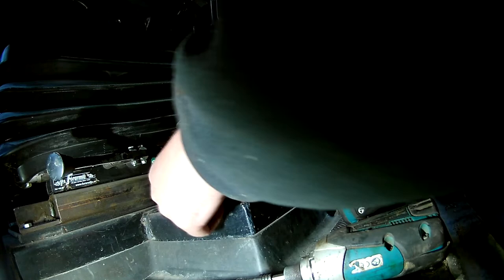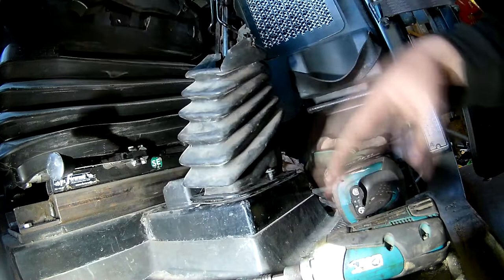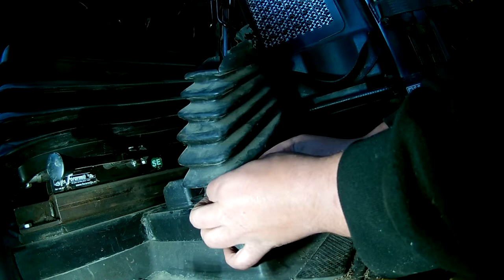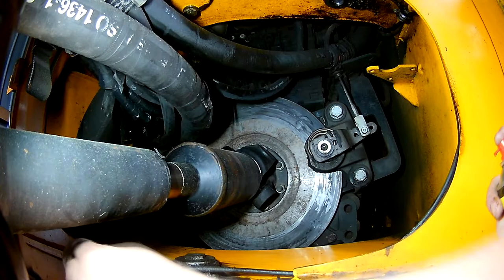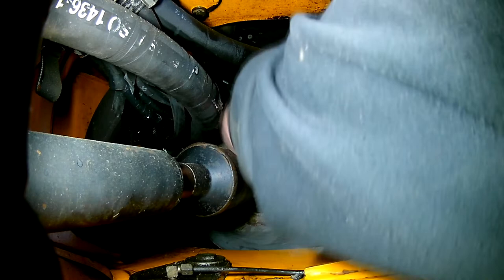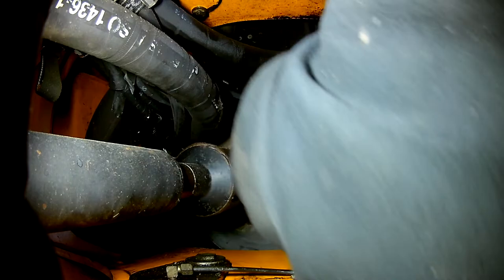I'll come to an even more annoying thing here. There has been signs of some oil leaks under the cab, so I was gonna clean up that. It seems there are some models that have a hydraulic parking brake — this one just has a cable operation. It was a little bit oily with some grease down here, so some cleanup. I made sure that the brake disc for the parking brake was cleaned up as best as I could.